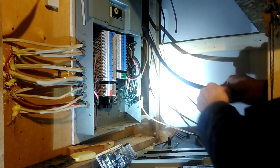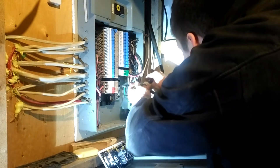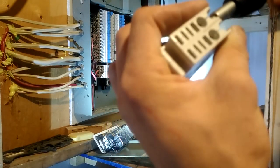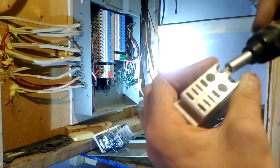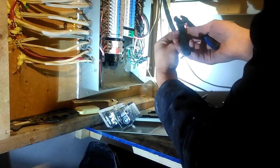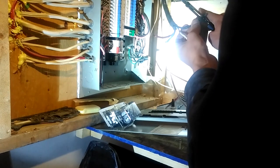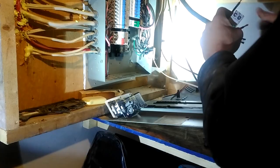I went back inside and ran the cable, leaving enough slack to work with since I was a little short. Here's the same process — I started by stripping back just enough cable to reach, making sure I have enough wire exposed. You want the casing to end right where it goes into the panel. I have the breaker in my hand — same as the receptacle, just undo the screws and it opens up a port where you plug in about half an inch of cable. Strip the ends again. Red and black go into the breaker — orientation doesn't matter. The green goes to your ground bus bar, where you'll see other green cables.